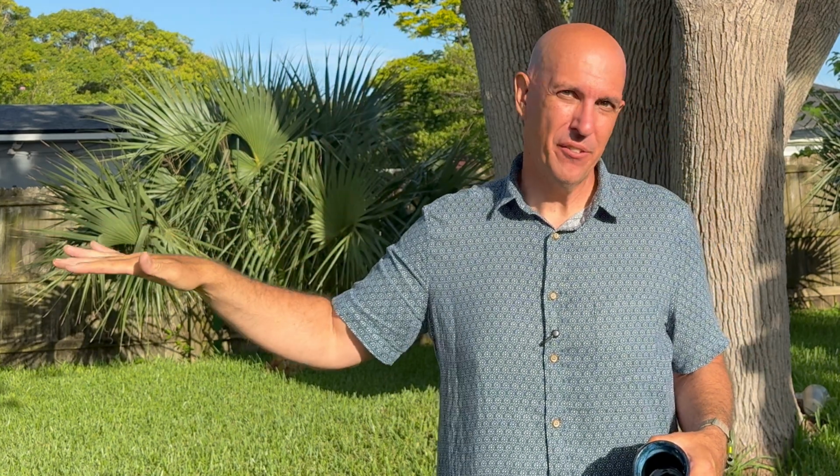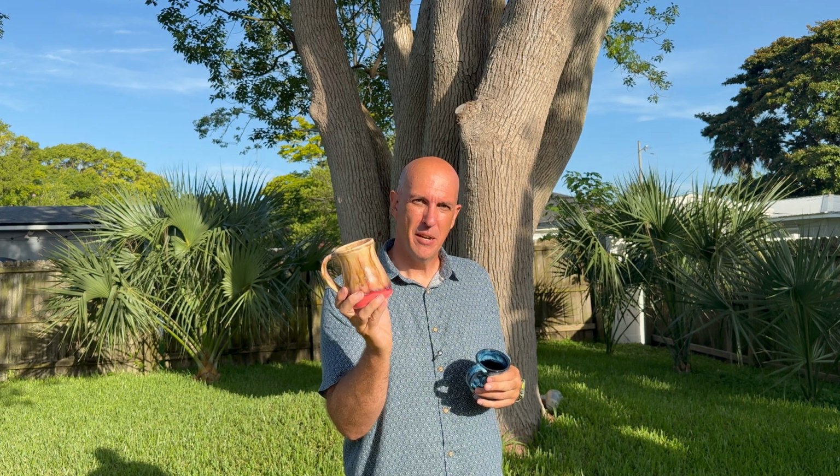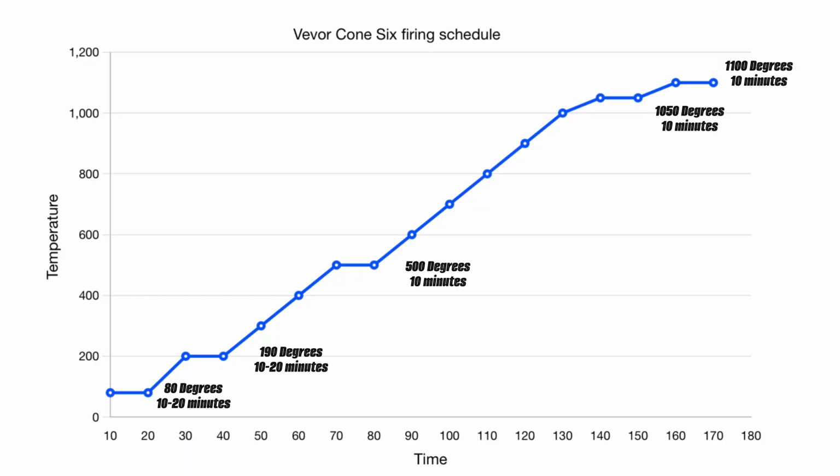So what I ended up doing, and I have a whole separate video on this, so I'm going to leave it in the cards right here, and at the end of the video, definitely go watch that video on how I achieved the perfect cone 6. But basically, I did a hold at 50 degrees below peak temperature just to let the kiln even out, just to let everything get heated all the way through, much like you would cook brownies up to temperature, hold them at that temperature for a little bit longer. And then I did a small hold at the peak temperature, 10-minute hold, which did achieve the perfect cone 6, and I'm going to leave the schedule right on the screen right here. You can screenshot it. We did end up achieving the perfect frozen pond, so watch to the end and you can see how to do it.